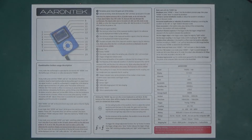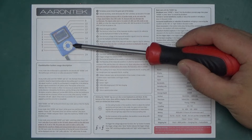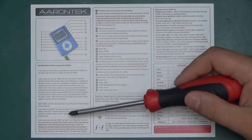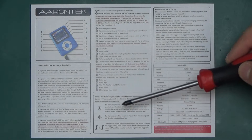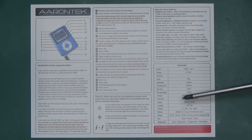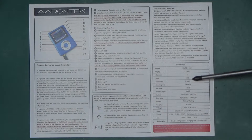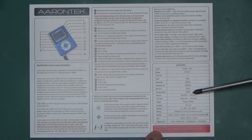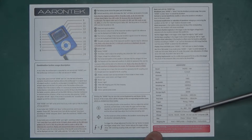There's a nice piece of card with a spec sheet, mounted into a reused fake iPod case — which is funny. There's a combination button usage description. Parameters: 1.8 inch screen, input 1M ohm, 20MHz bandwidth, sampling rate 100 megasamples per second, rise time 20ns, storage depth 334KB, 800mAh battery, 6 hours continuous use. Charge at 5V — 1A, 2A, or 4A — do not use the computer USB. It's probably quite power hungry for charging, which is why it says that.